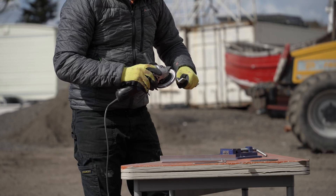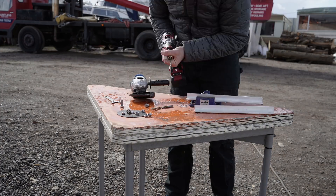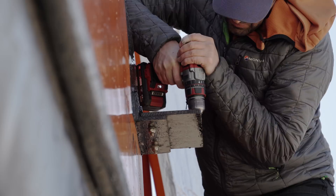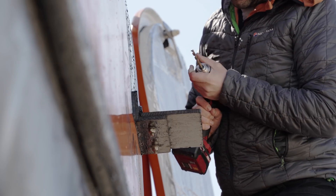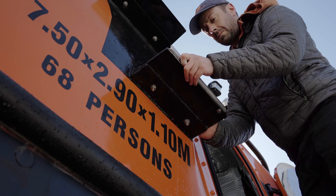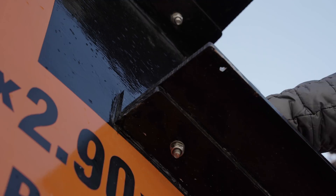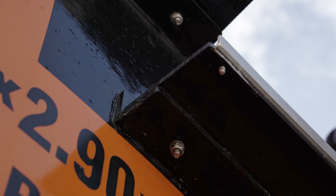Grinding with cut-off wheels, and then a corner finishing with a flat wheel. The drilling, of course, was a joy. I've had to do so much drilling of stainless steel that it's nice to carve through swiftly with some nice ribbons of swarf. The supplier gave me equal angle instead of unequal angle, so instead of going through the replacement palaver, I'm going to install it on top so there's enough of a lip. When using a hand drill, and especially with thick pieces of material, alignment can be off if you mark up at the start, drill everything, and then attempt assembly. I usually drill the first hole, put a bolt through to keep everything in place, and then mark and drill the second, and so on. This saves frustration when slight centering errors of just a millimetre or two can multiply into totally wonky assembly.